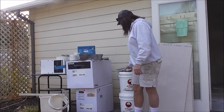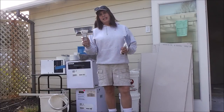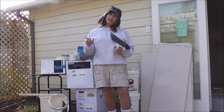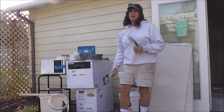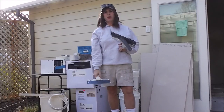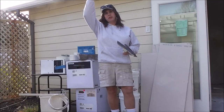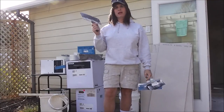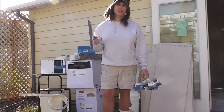Using my different application trowels here — you'll see I have three different sizes: a really wide, a medium, and a not-so-wide. What this actually does is I go put on three progressive coats of drywall. First I'll stick the fiberglass tape on, get that in position, and hit it the first time with the sheetrock mud, thinned a little bit with water. Once that's dry, I'll come back and do a second, wider application. When that's dry, I'll come back with the widest application. That allows for a really smooth, contoured finish with a lot of feathering on the side. The more care you take in applying the mud with the trowel, the easier it's going to be to finish sanding.